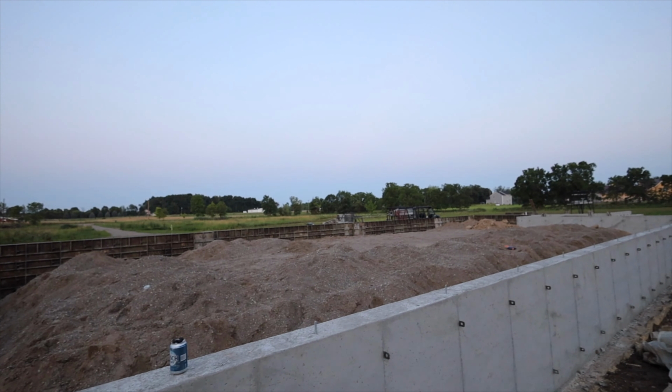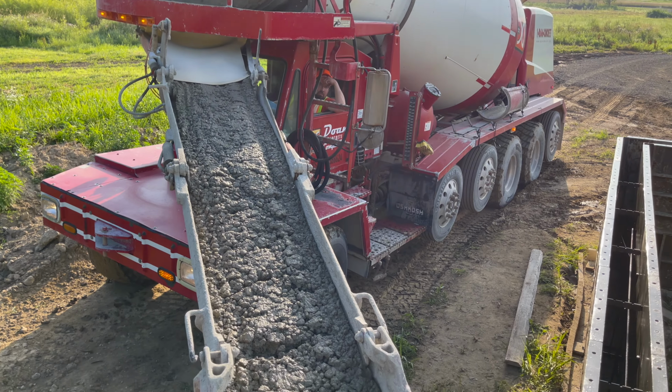That was a lot of poured walls. Just have to plumb these corners, and then in the morning we will run a string line and straighten out the tops of the walls, and you kind of adjust it as you pour because it's going to change. So I got about an hour left to work, and then it's time to get some dinner and hit the hay. We'll see you in the morning. We're gonna pour these walls.